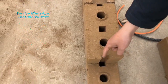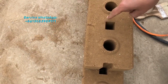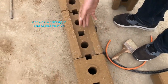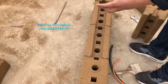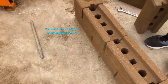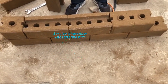When two bricks are placed together, the half square holes on each brick join together to form a full square hole. And this is the U-shape brick. The U-shape bricks are normally used at the window sides of a wall — you need reinforcement to support the window area, so these U-shape bricks are placed at the window location.